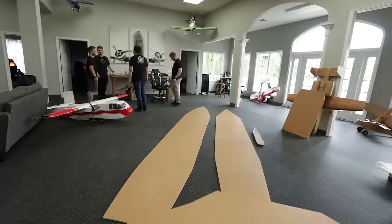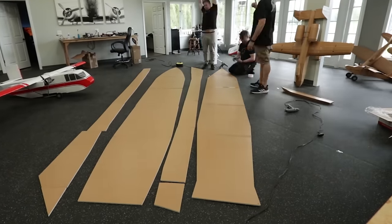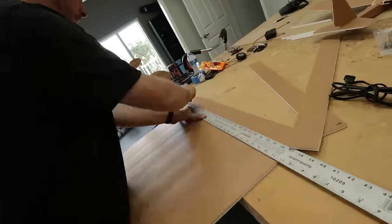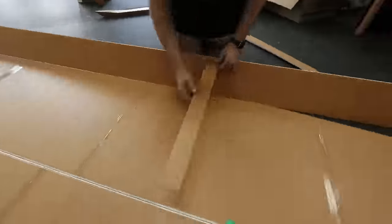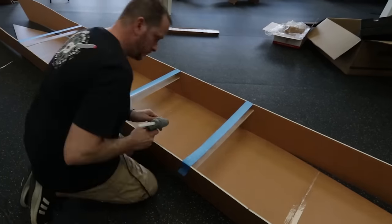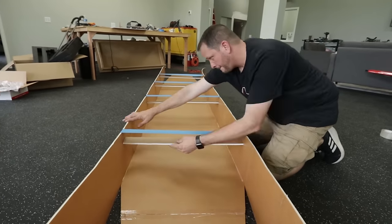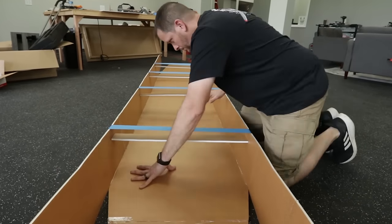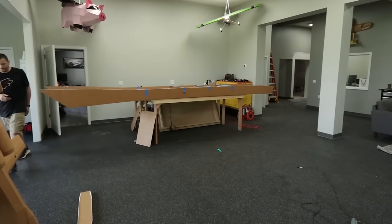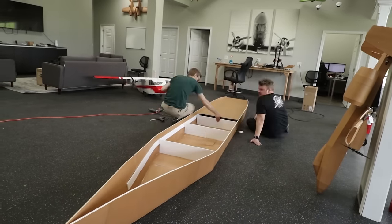The top deck is actually a little bit bigger — about an inch and a half bigger than the bottom deck — so it's going to give the sides an angle. What we don't want to do is actually have to manipulate the piece. So I'm going to cut a bunch of strips and use those as formers to hold the piece at the angle, so when we put the glue down it captures that angle perfectly. We already did the sides and now we're pulling in each side of the boat to give that classic hull shape.